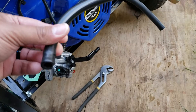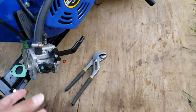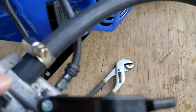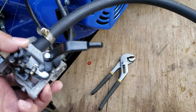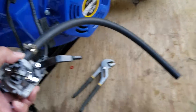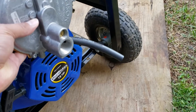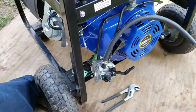Back on that theory — this is the hose that originally came with it, connected to the propane regulator on the generator. That hose was too short, so this is the included hose that came with US Carburetion. This clamp was already on the original hose; I'm going to reuse it. The directions for the snorkel say you do not need to remove the carburetor, but I'm on a mission to discover whether I can use this port and just connect this hose to a regulator. I'm thinking about putting the regulator somewhere around here.